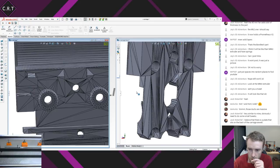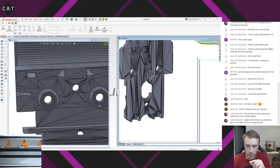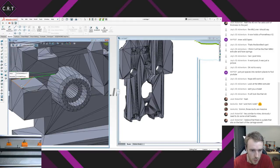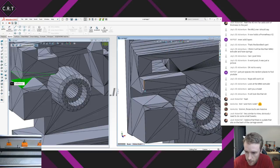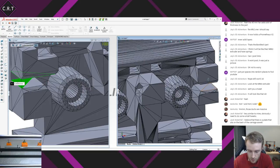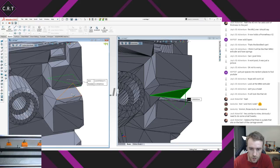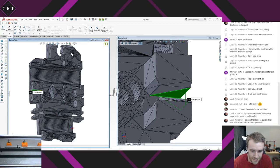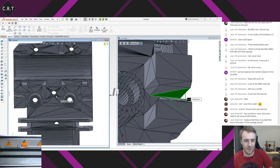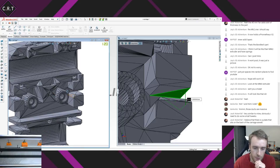Cable management. One thing I wonder, so on my clone back here, the belts almost slip out because the gap between here I think was a little too wide. So that's 2.1, what were they before? Aha, 2.3, so they've decreased the gap by 0.2mm, which would be just enough to, again, 2.3, down to 2.2. Interesting. This one was 2.1. So one of the sides is 2.1, the other side's 2.2. Okay, sure, that must have been deliberate. Yeah, not sure why they did that. They're probably meant to be the same and someone's made a boo-boo.